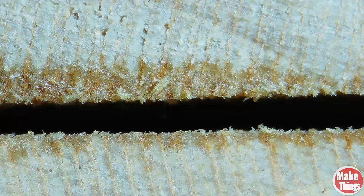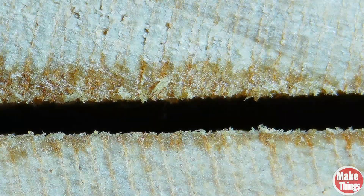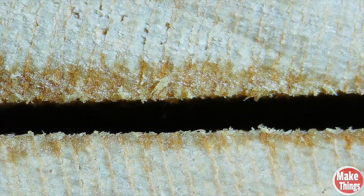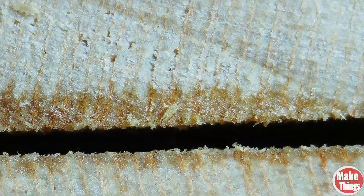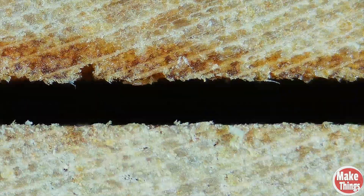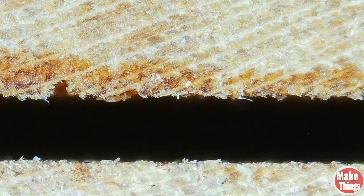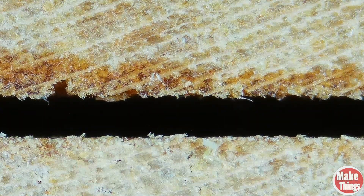We're under the microscope now, comparing each species side by side. The cold oil test piece is on top and the heated sample is below. First up, curly maple — and just look at that. There's a dramatic difference: penetration on the cold piece is nearly double what we saw with the hot oil. Moving on to the oak sample, this one's a little more spotty along the edge, but in the larger sections the cold oil once again comes out ahead. And last, cherry — I saved this one for a reason. Look at that contrast: while the hot oil is barely present, almost non-existent, the cold oil penetrated four to five times deeper. Fascinating.